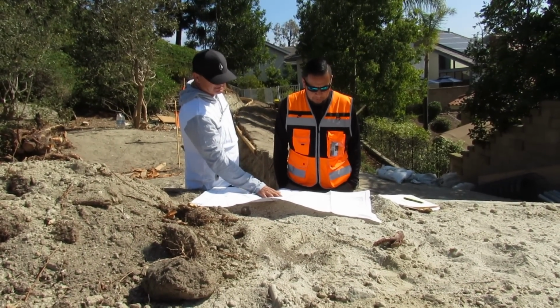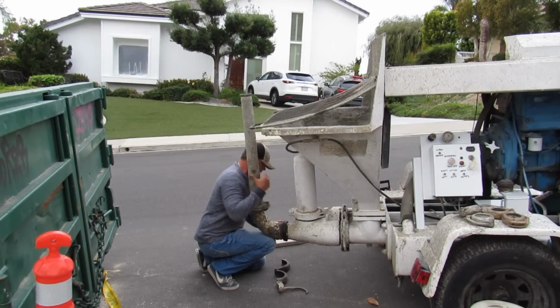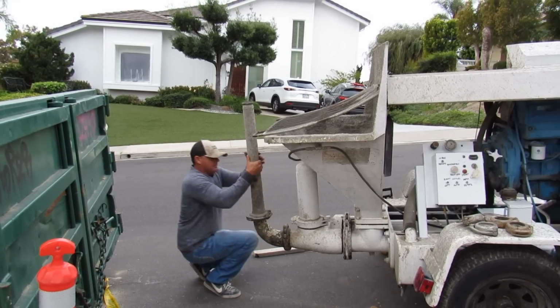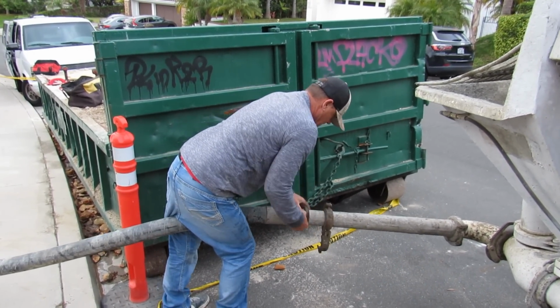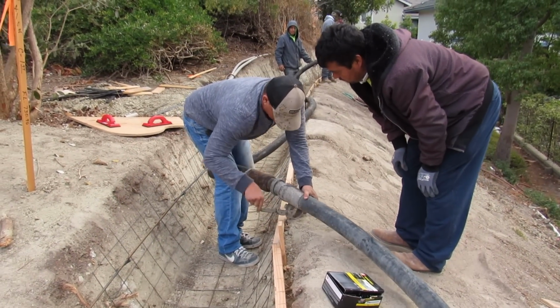Here's an inspector. We're going over all elevations. Javier was supposed to be here that day, and he had both the lasers in his truck, so we had a little issue with that, but we had all elevations right. And everyone's asking me, most companies would shotcrete this. They wouldn't even attempt to pump this, but they're not West Coast. So I just bring my own pump, and I'll pump it at a stiff 3, and I'll stack it on that wall, and they'll freehand float it.